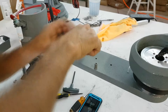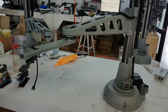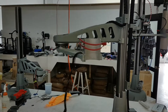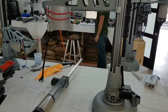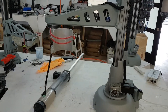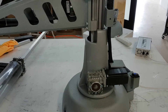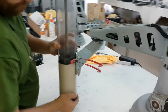Next, we are going to power on the machine, connect to it, and try homing all of the axes. With the home all command started, the Z will home first, then the base, and then the distal arm. Once all three have been homed, the distal arm will move out a bit. With the machine homed, you can then control movement of the machine manually through the web interface. Here we are moving the Z arm down all the way to its maximum limit. Since we placed the Z-probe switch correctly, it will not crash into the base. When a print starts, this is how low the machine will go, allowing you to see how close the nozzle of the extruder is to the surface you are printing on.